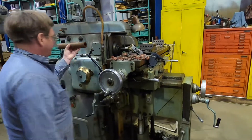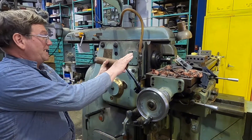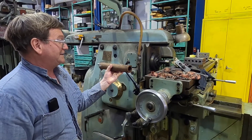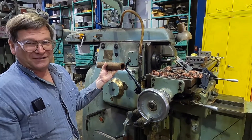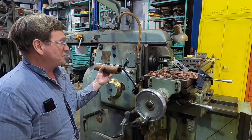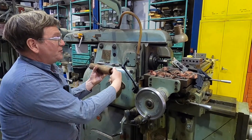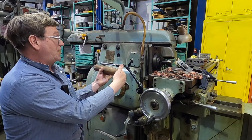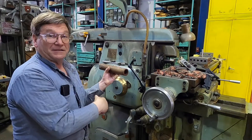Here's what was going on. Let's imagine that this is the spindle in the machine — bearing, bearing, precision surface on the inside. The machine got damaged, so that was the reason why we were doing it. It was to repair the machine. The machine had a crash, and the crash was hard enough that the surface inside the spindle was off. I don't know if the spindle was off because it was squished or if the spindle itself got bent.